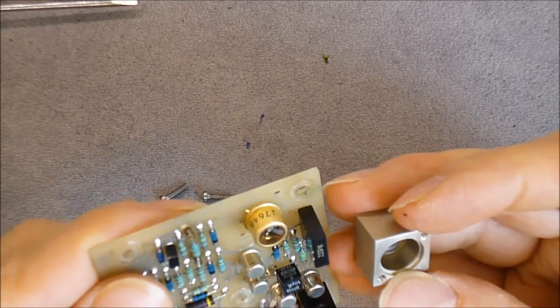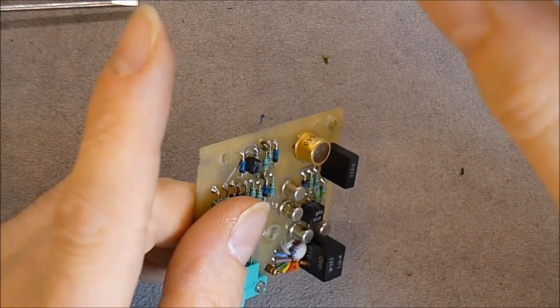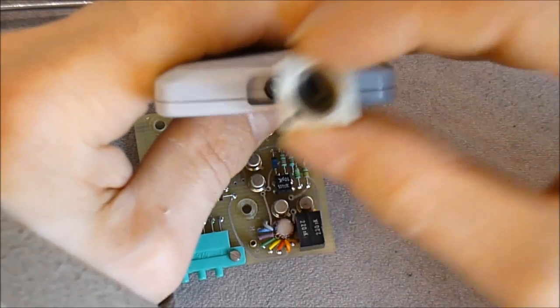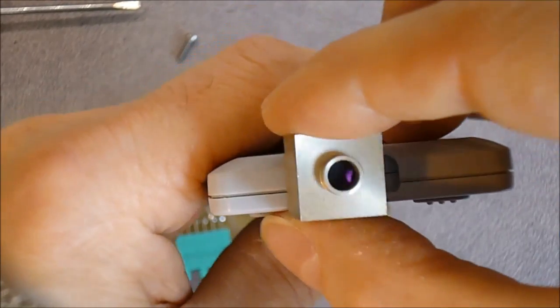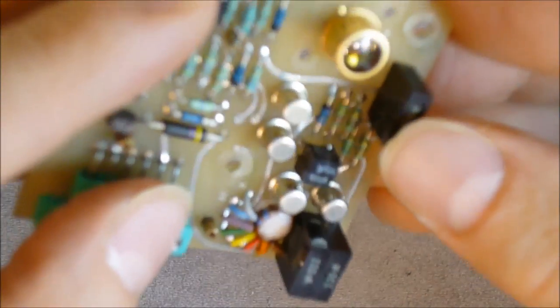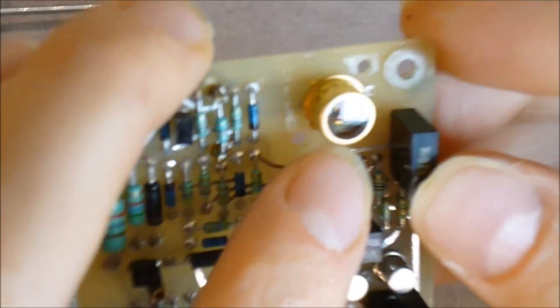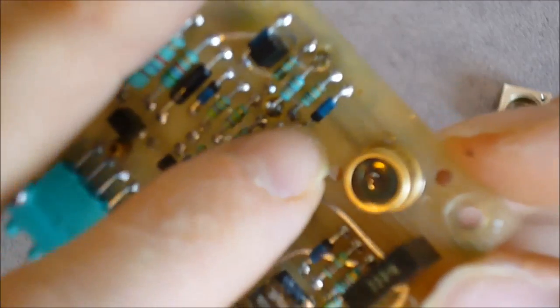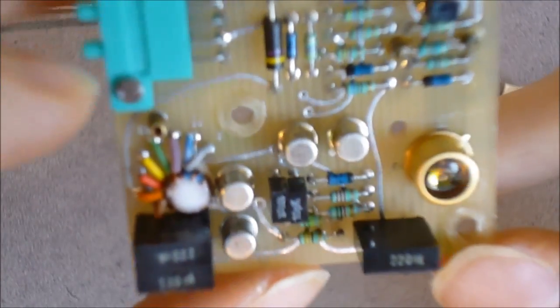As expected. So we have some kind of filter in here, probably for infrared. Yes, infrared will pass through the filter. Interesting. And here is a sensor. It must be a photodiode, but the top is weird. Not sure if it is blown or something. I see some cracks inside. The number is BPY13, 1976. So it is a photodiode. And here we just have transistors, so a simple amplifier circuit probably.